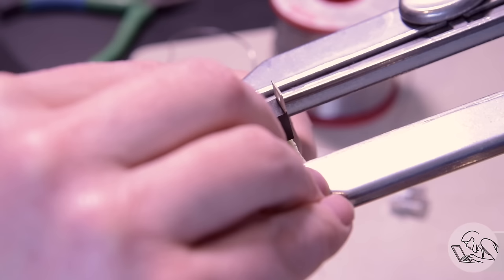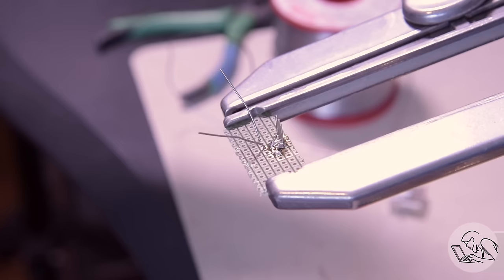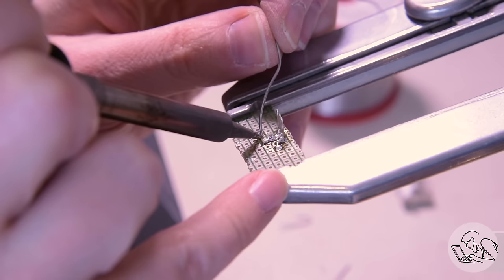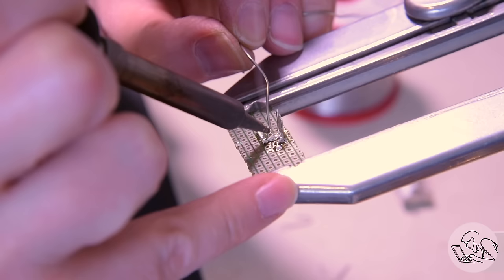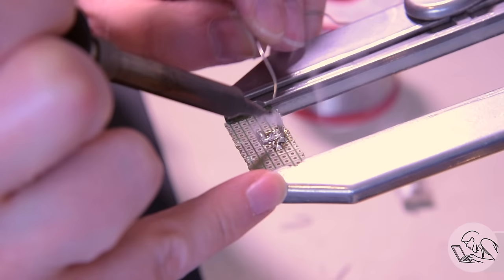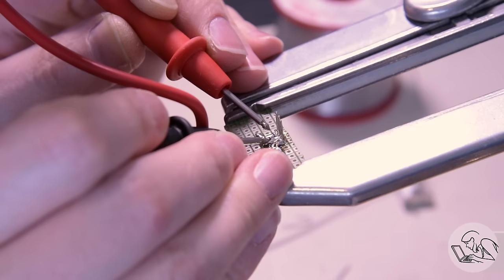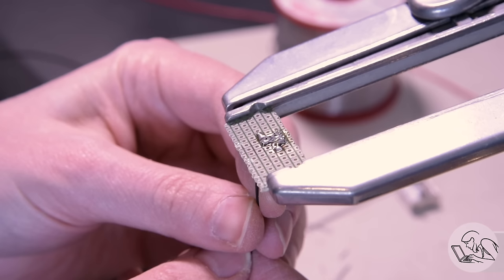With the regulator in place, I can start getting the two capacitors in there, wiring them up exactly as they were on the breadboard but more compact. If you're new to electronics, you may not have seen that holding fixture — that's called a PanaVise, a circuit board vise with a quick release for flipping the board over, which is really nice for this type of work. They're not the cheapest, but if you're doing a lot of circuit board work it's pretty essential. With the basics hooked up, I'll do a quick continuity check to make sure things that shouldn't be shorted aren't, and things that should be are.